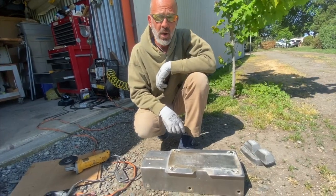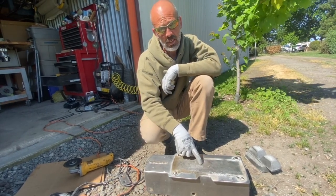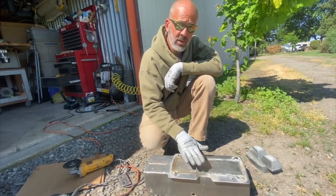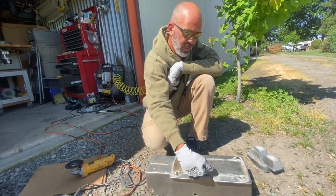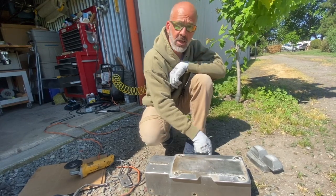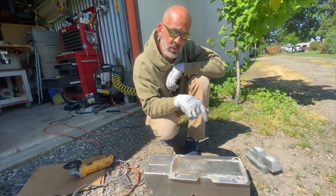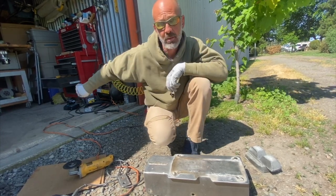Also the way I'm routing the wires — because I don't want to drill a big fat hole down through the middle to snake my wires down below decks — I'm building a riser plate out of G10 that's going to have an internal cable routing area where it'll come down the outside and through a watertight deck gland that goes into where all the control box and everything is, and then out to the batteries.